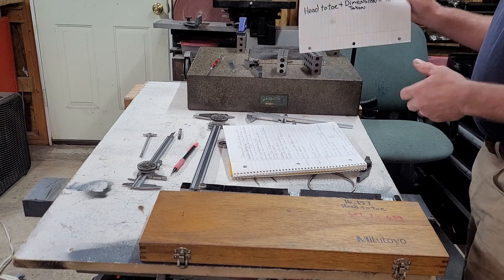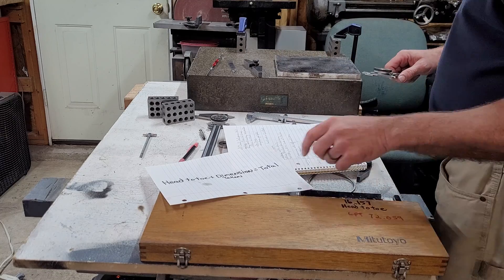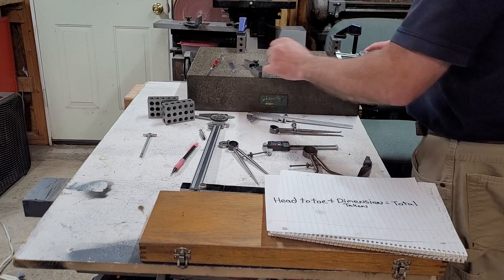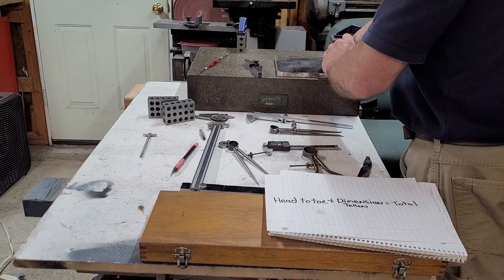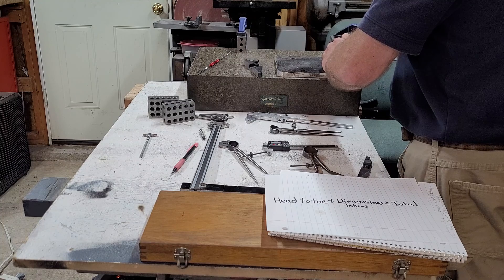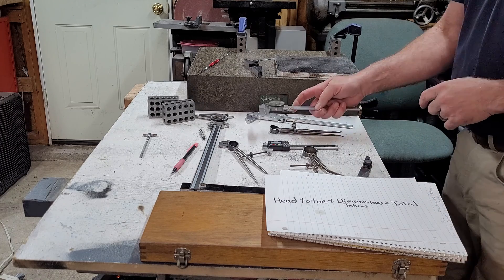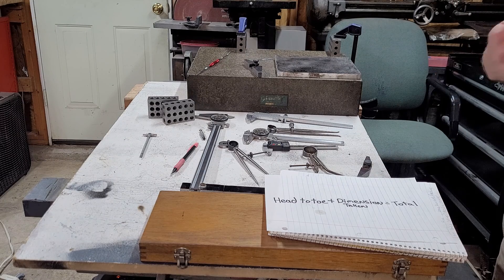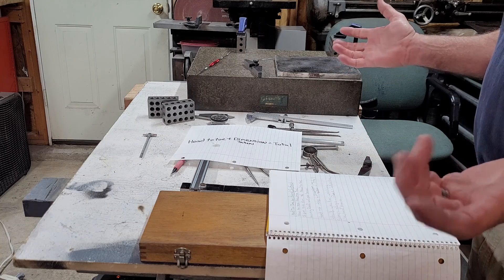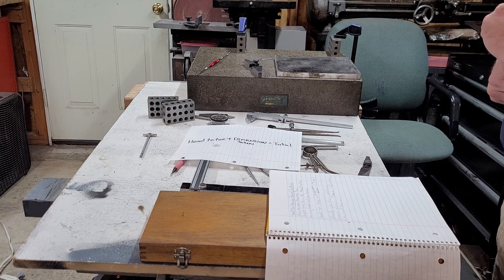I also want to mention scribing alongside a workpiece. You open your calipers up to the set dimension you want, lay it beside your workpiece, and mark it just like that. That's a pretty accurate line — you're getting precise with your precision marking. I know there are other things I may have missed, but anyway, thanks for watching Scoop's Garage today. Please subscribe, like, and share.